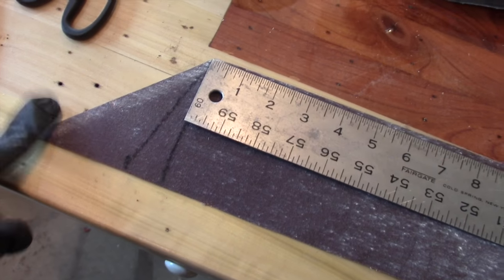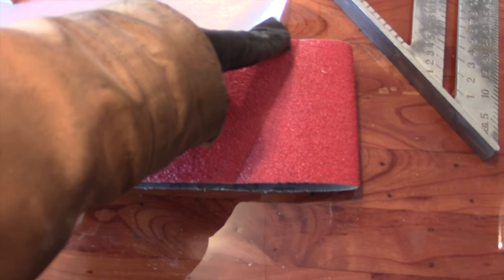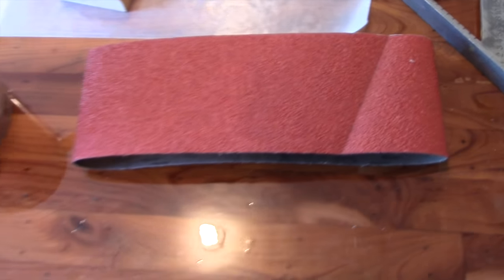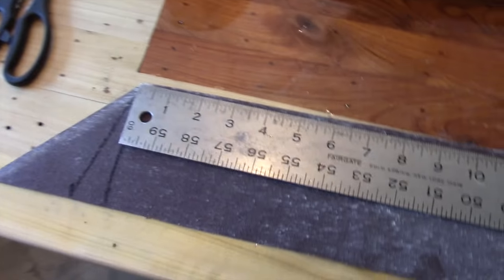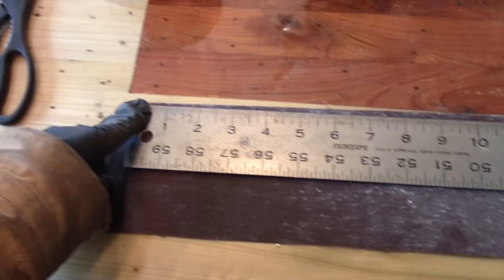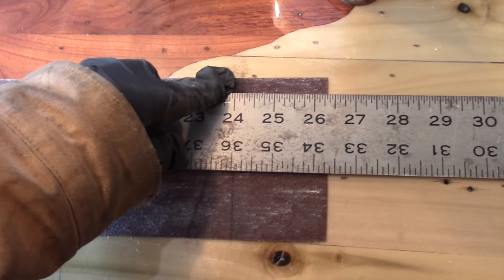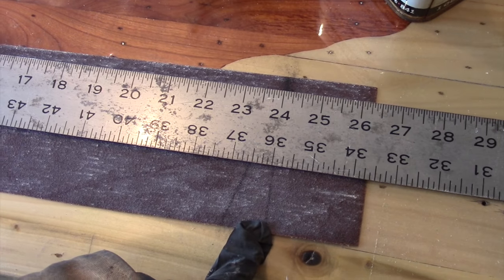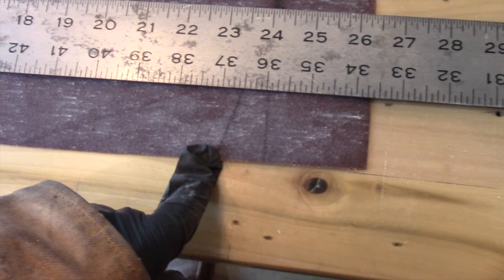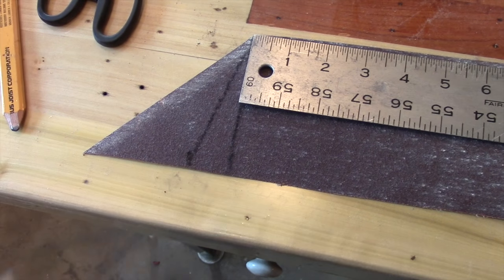This is the original angle from the belt I'm reusing — I'm not going to reuse that angle. For most smaller belt sanders I'm not sure of the exact angle, but if I draw a straight line, this one's about an inch and a half back. It doesn't really have to be a specific angle as long as both ends meet up so they mate properly. You just draw a straight line from where you want to start — my belt sander is 24 inches, so I go out 24, draw a straight line, then on the bottom side come back an inch. I went an inch and a half earlier but an inch is a little easier to measure. I did exactly the same thing on the other end — straight line, then an angled line back one inch.